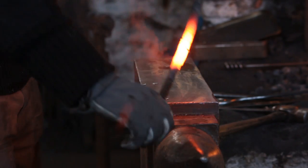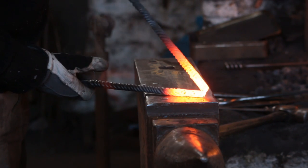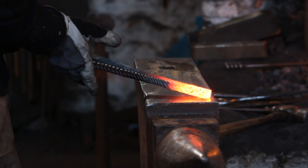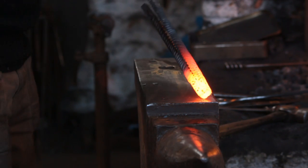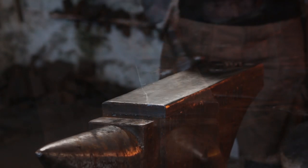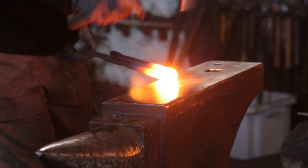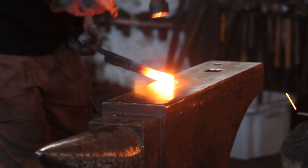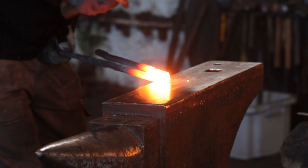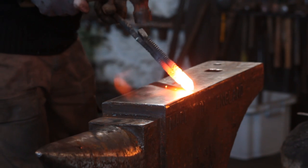Cool off the end section and fold it together. This is where I went cut through a bit too far, and that bend was at risk of shearing. So I took a welding heat in there and tacked it together — that will ensure that it doesn't fall off. That's the peril of bending poor quality raw iron: it tends to rip itself apart if you bend it too hard. So that's tacked together.